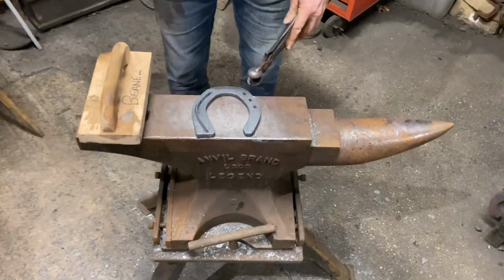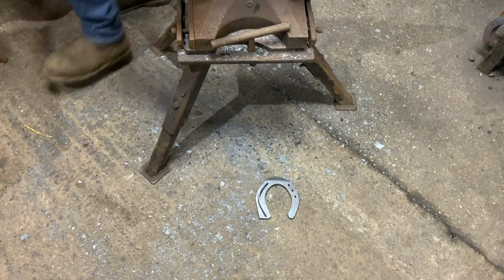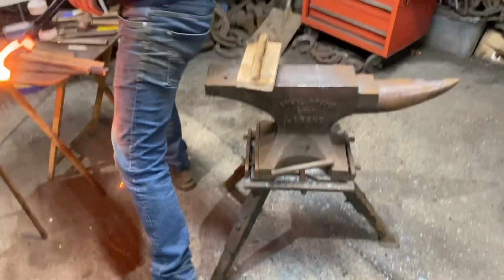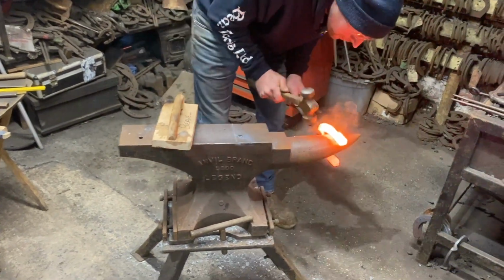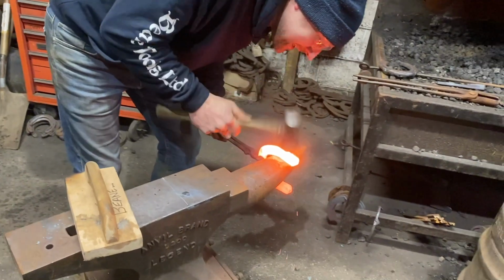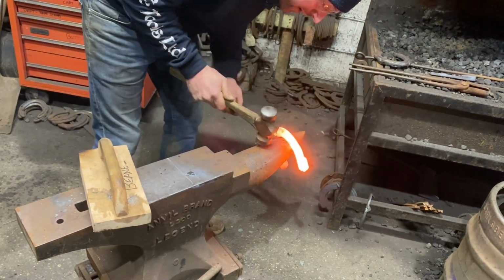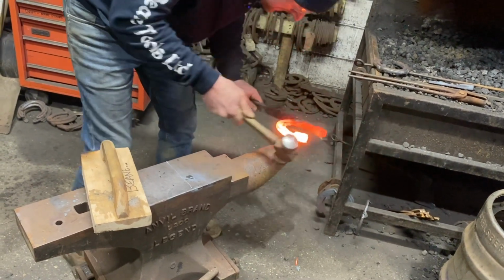Well, I keep saying that's our Spavin shoe. That's our lateral heel extension Spavin shoe. So, Spavin now, let's bring it out. Let's weld that little bit, look. Now, while it's still at welding temperature, bend the branch. Okay, so I've welded it and bent it at the same time.